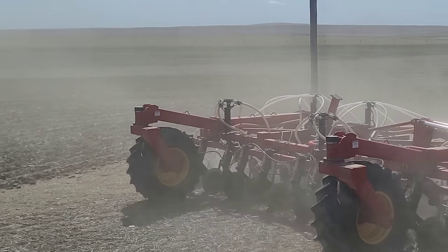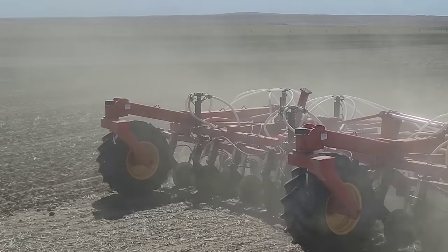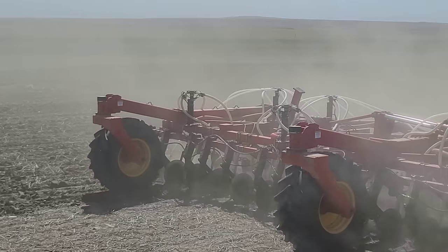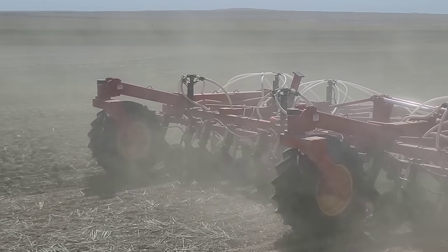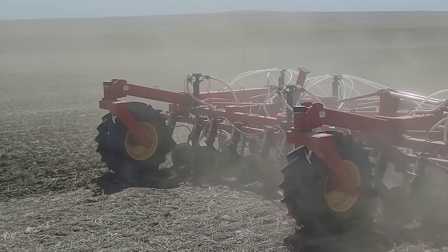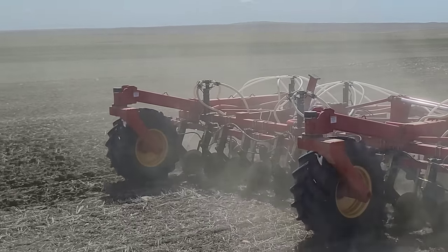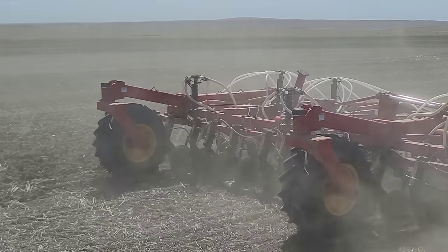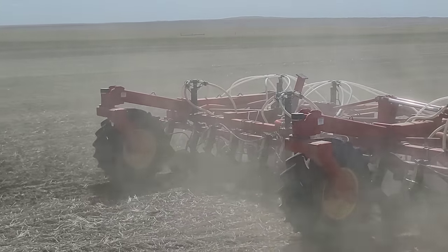As I was saying about that caster wheel - that is not the end of my wing. You always have to remember that you can't be like, 'there's my caster wheel, as long as my caster wheel clears it I should be fine.' No, that's not the case. I do believe I have three shanks on the outer side, which is three feet because they're on 12-inch spacing, plus I have a little extra framework sticking up past the last opener. So I would say you have four feet sticking out blindly that you can't see back there. Remember that when you're going around power poles.